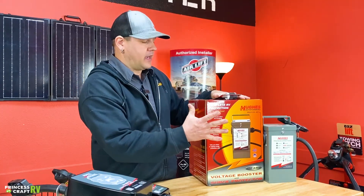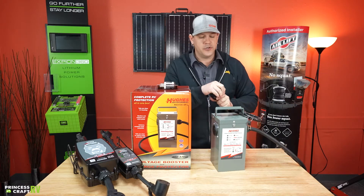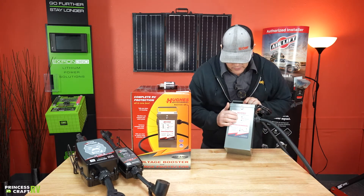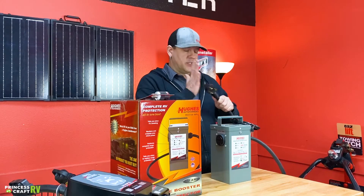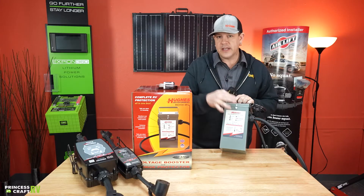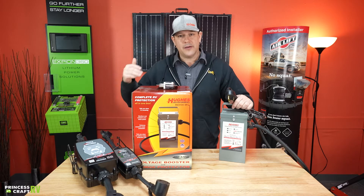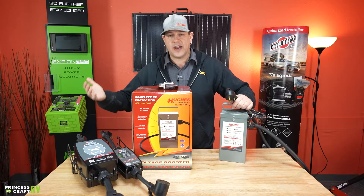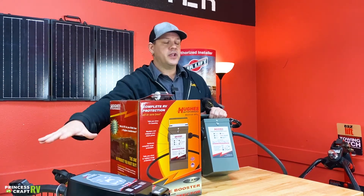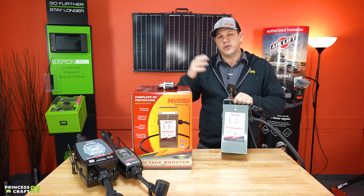The other option is to go with an actual auto former. This box here is a 30-amp version. This would plug into your power pole and then your trailer would plug in here. This still gives you surge protection, but it doesn't offer Bluetooth compatibility. You still get 2,400 joules of surge protection. But instead of disconnecting when your voltage gets low — which is typically what we see as an issue in parks, a brownout or low voltage due to everybody's air conditioners firing up at the same time, especially in the heat of summer — this thing is going to boost voltage to you. So instead of disconnecting like a surge protector, it boosts the voltage to keep you within a safe operating range. Once it drops too low, this thing will cut out, as it can't boost when park voltage gets too low.